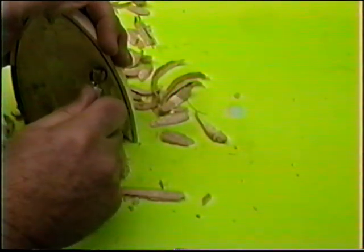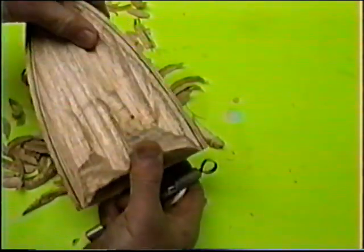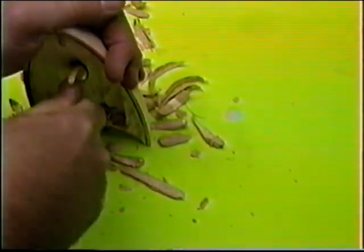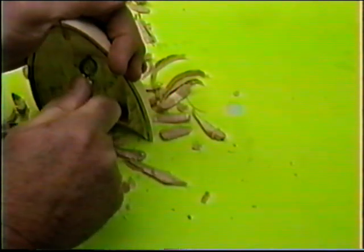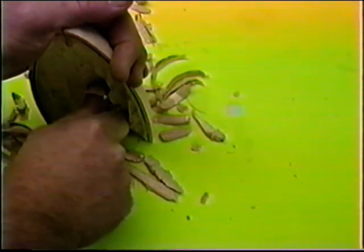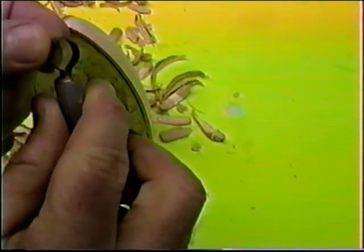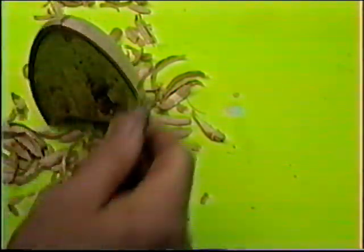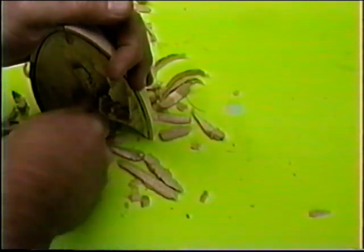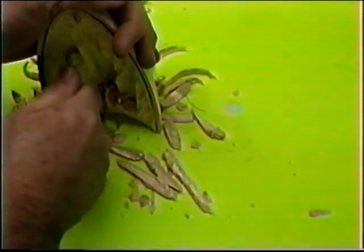Now, even if this were a wingtip, a cowl, it wouldn't mean anything. We need to always know if we're getting thicker or thinner, where we still have material that can be removed. And it's, of course, a real pain by the glue seam. It doesn't do much for the blade life either. And I don't know why, but if you buy these gouged blades, anytime I buy them by the dozen, because on a project like this, if the blade goes dull, you hit one glue seam or whatever, carving can be miserable, and you put a new blade in and it really goes nicely.